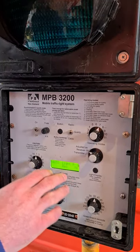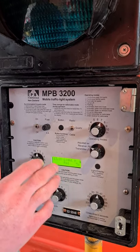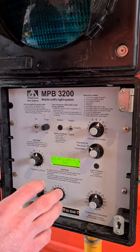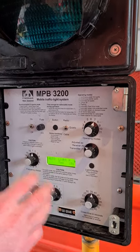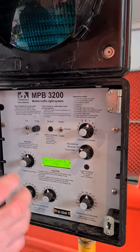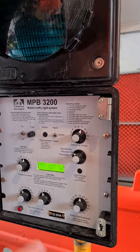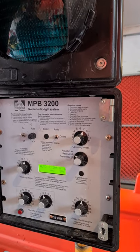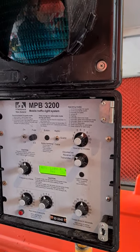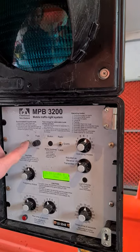These are 12 volt units. When they have less than 12 volts they cannot work, because they require 12 volts. When they're at 11.9, even though they're working, they could die at any time. Around 12.1 to 12.2 is when you should be changing the batteries, because they drop about 0.1 to 0.2 of a volt a day. Anything 12.5 and above is good, but when it gets close to 12, think about a battery change.